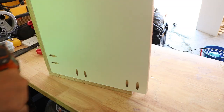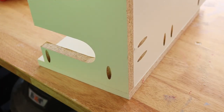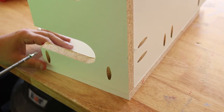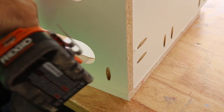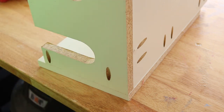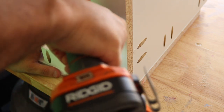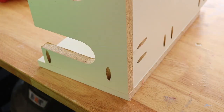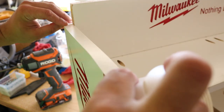Now that the right side is on, flip it over and put the left side on. The pocket holes added on the back play a huge role in creating support for this shelf. For the drill hanger cutouts: they are 2 inches wide, with gaps of 3 and three quarters between them. On the left and right sides you start with a gap of 3 and a quarter, cut a 2-inch slot, then another gap, another 2-inch slot, and another gap.